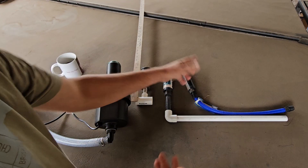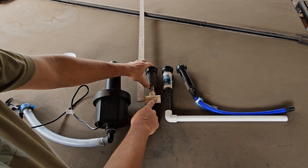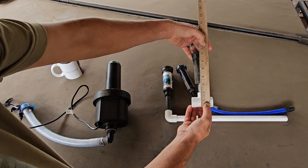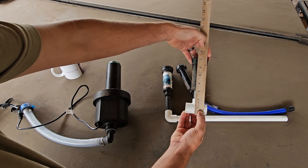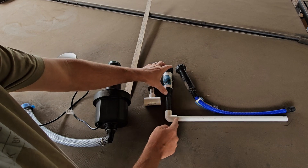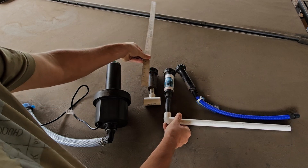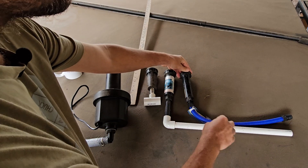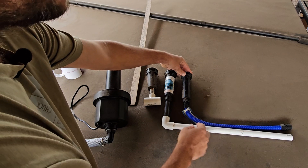If you're going to be installing a short sprinkler, your trench could be on the shallow side — but the shallowest it will ever be is about 7.25 to 7.5 inches. If the riser is a little bigger, plus you've got a 4-inch head, it could come down to something like this — that's almost 11 inches. And if you're using a flex pipe, since you can't kink it, you've got to give some extra space, though it's not a big difference.